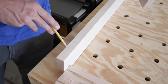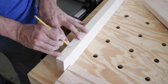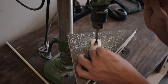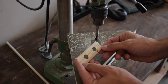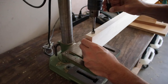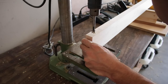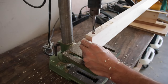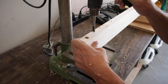I did not want to use pocket holes to join the main bed frame together, so I decided on doing two through holes that I could plug with nice walnut accents. I started by tracing a line to get the circles right in the center, then made a quick template to make sure I had my holes correct. Since I had two beds to build, this made the process quicker. I took them over to the drill press to make sure the holes were nice and straight, using the head of the Forstner bit as my depth gauge — I had to brace these boards along the workbench to keep them flat.